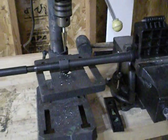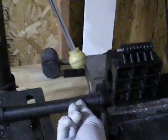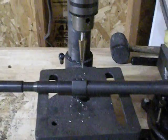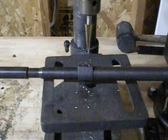Basically once you've got it set up this way, what you can do is drill one barrel, remove the gas block, pull this barrel out of the action, slide another one in, and everything should already be trued up and level. So it's a really quick way of doing it if you're going to be doing multiple barrels like I am going to be doing today.